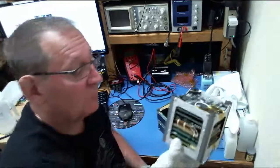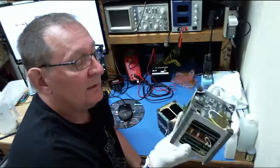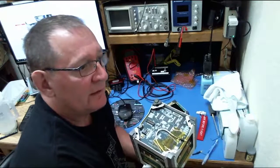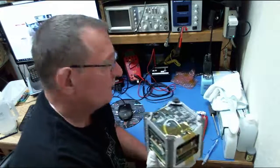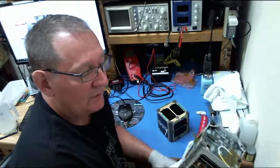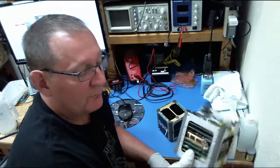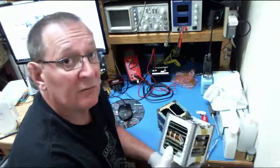This engineering model has been used, the batteries have existed since Fox-1A, so that's kind of a good testament as well to the hardiness of the NiCad, because I've had this for 2.5 years, and it's been charged, discharged, and otherwise mistreated, and the batteries are still doing a fine job. So I use the same batteries. The IHU is a recycle from the Fox-1A spare, but it can be loaded with the new software. Of course, the MPPTs are the new brand, and the transmitter and receiver are actually the Fox-1A spare as well.